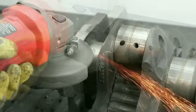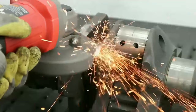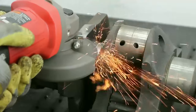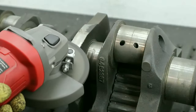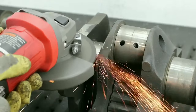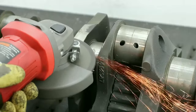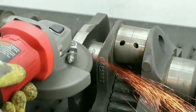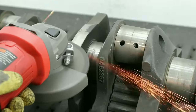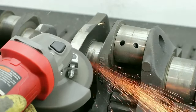Now I've had time to look at this crank and give it a more detailed evaluation, I think there's more that can be taken off safely than I had originally anticipated. I'm expecting that by the time we've finished, we'll be well in excess of 5 pounds off the crank, and the moment of inertia will probably be about 10 to 15% less. That's going to be good — this engine will pick up RPM much quicker than it did before.